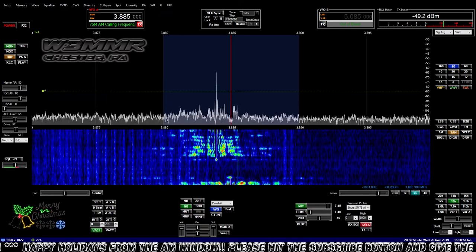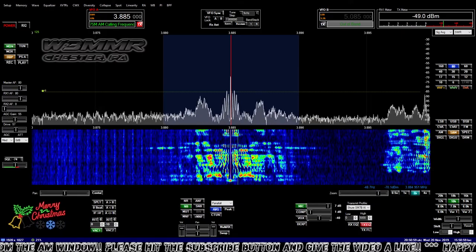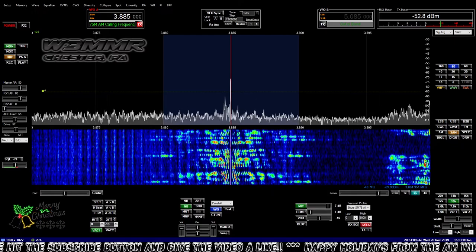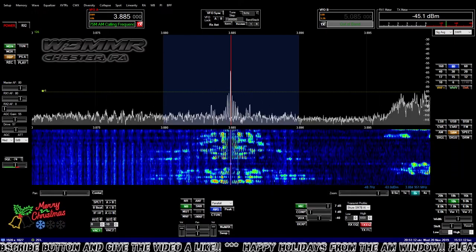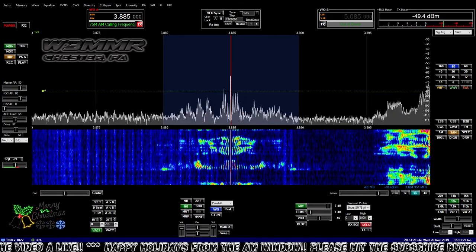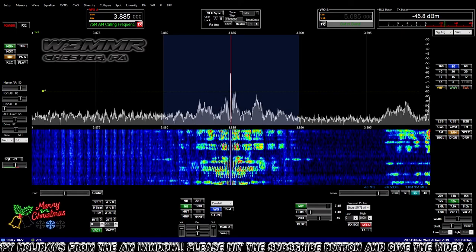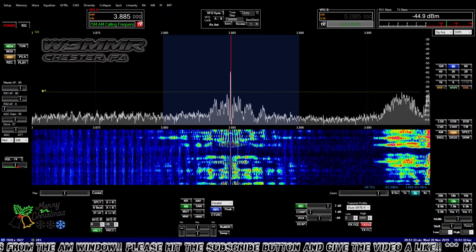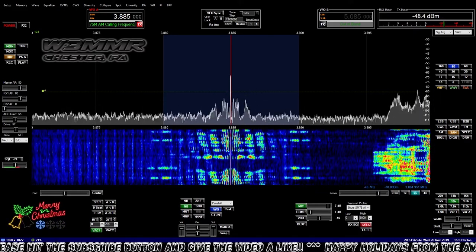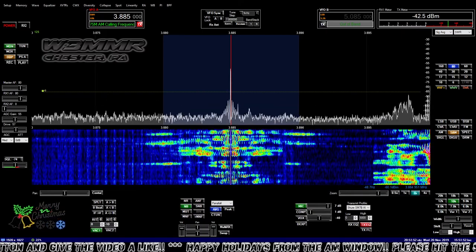That's where it would start falling apart first — the front-to-back, right? If you look at the three-dimensional plots, you can move it around but it is huge. As soon as you go over the top, the signal strength drops exponentially. The equivalent angle at 45 degrees off the back is minus 4.59 dBi. The front-to-back is off the chart. The beam width of the array is 61.7 degrees at 23.7 degrees of compass heading and 85.4 — so there's your beam width, 61.7 from center.